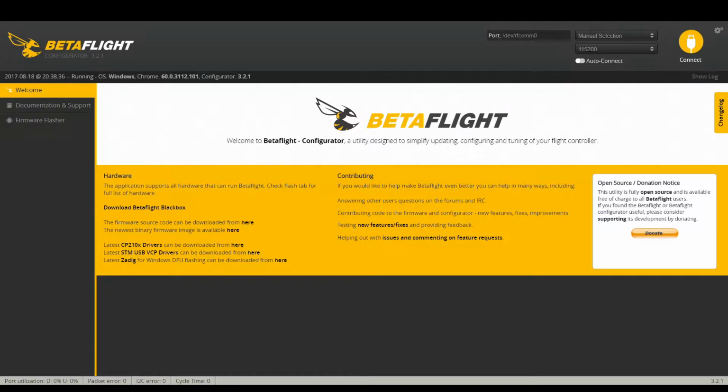So this is going to be the Betaflight and BLHeli section of the videos. Not sure how long this video is going to be, but what this is going to consist of: I'm going to flash the DYS board that I have installed into the SCX 100. I'm going to do a complete setup, and then I will move to BLHeli. Go ahead and set the ESCs up, and then proceed back to Betaflight to do finishing configurations.